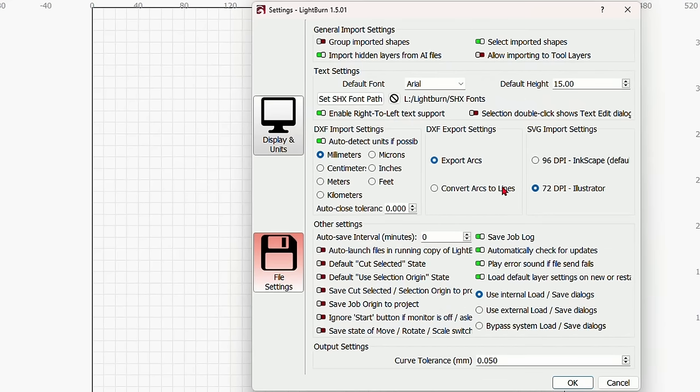Our red layer is going to stay the same, our black layer is going to engrave, but the mistake that I have here is that the black layer is below the red. So I have to move the black layer to the top like that. Black first, red second, and now I'm ready to run this job.